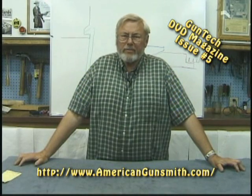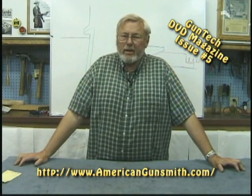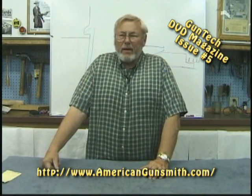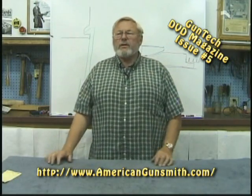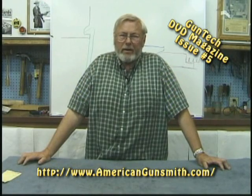One common type of locking system now is the rotating bolt. Remington, of course, has a rotating bolt, but the extractor is fairly light, so compared to spring tension it doesn't have a lot of mass trying to push it out of the way of the extractor cut in the cartridge. By the time it has to extract, it unlocks and then it takes a fraction of a second before it actually starts to move back, so it has time. Remington hasn't found it to be a problem with their extractor system on the automatic rifles they currently make.